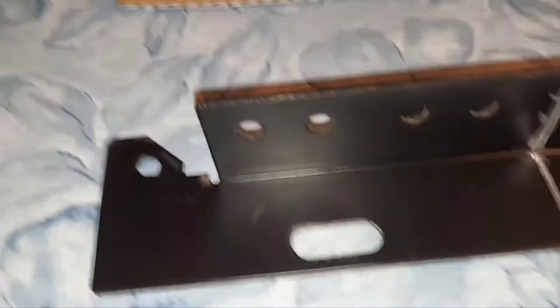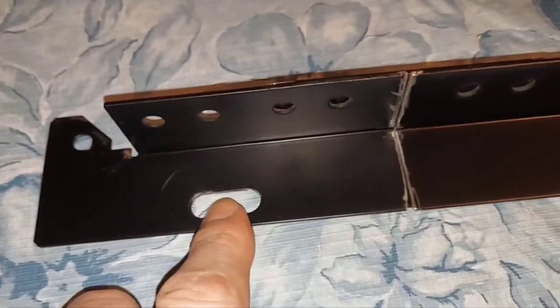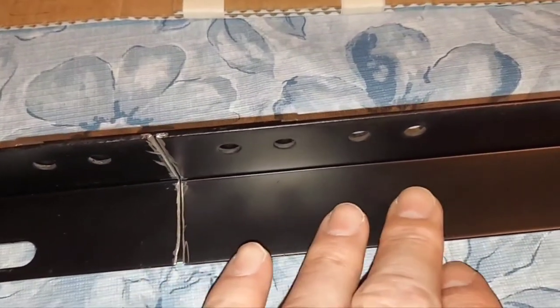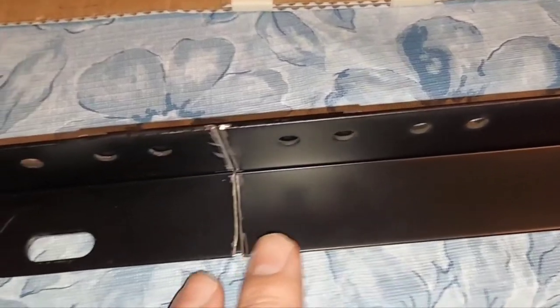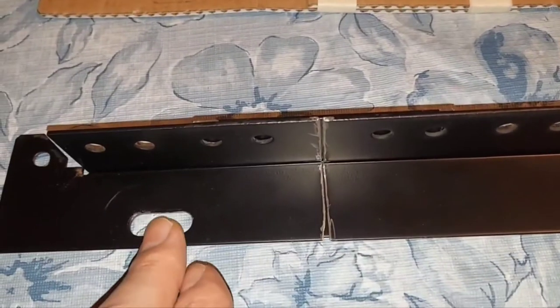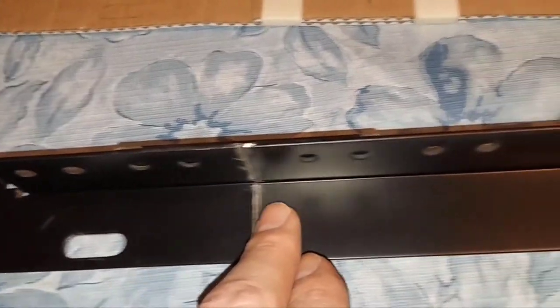What we're going to have to do — I've made the decision for this one — is the support bracket, that piece right there, is going to be behind there and it needs to be on this side. This is going to be the bottom mounting bracket. This piece of metal for the bottom needs to be flat because it actually sits on top of the lower rail that holds the monitor. You don't want any raised area here because when you tighten your bolts down there'll be a slight gap, like an eighth of an inch, and I just don't want that. I want it to be a nice, clean mating surface across there.